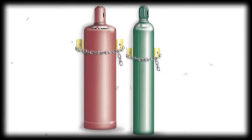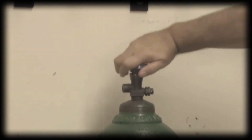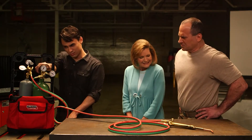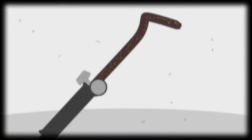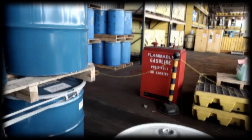Here are some basic protocols when setting up your equipment. One: chain cylinders in place to keep them from falling over. Vent the oxygen cylinder by briefly opening and closing the cylinder valve before attaching the regulator — this blows any dust or dirt out of the cylinder valve. Check the regulator inlet for dust and dirt. Open the oxygen cylinder valve slowly, and stand to the side when doing so, as a sudden change in pressure can cause heat — in some cases enough to ignite a fuel-oxygen mix. Keep your torch away from combustibles.